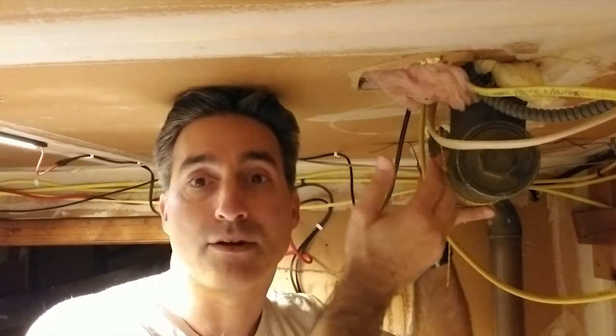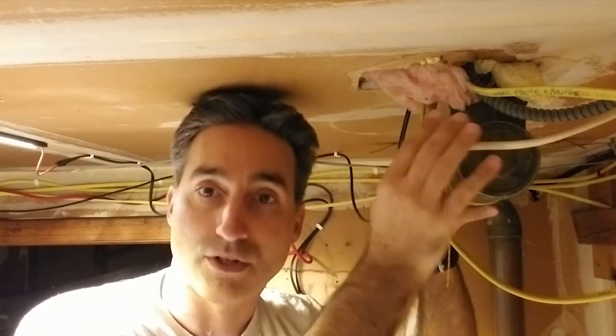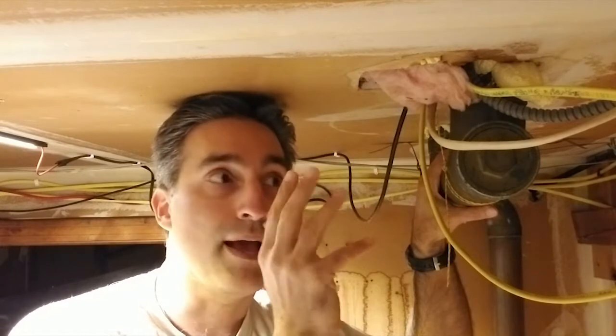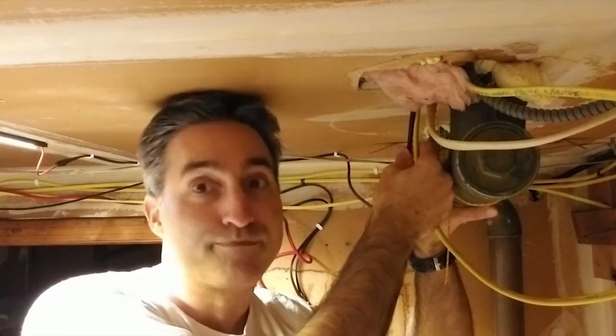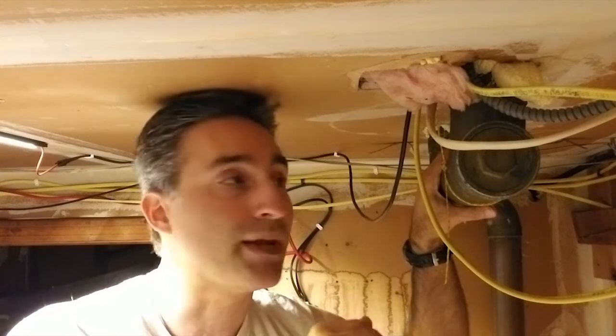What can happen is in the event of, say, an earthquake — the structure shifts, the wire can get pinched between the wood structure and the pipe, and could compromise the installation, cause a short, cause a fire. You also don't want to have low voltage signals sharing a path, even in the same channel between wall studs with high voltage. Same thing could happen: a nail gets driven through, and somehow these two end up pinched together — you now take 120 volts and send it down the low voltage line. Could blow out whatever you have connected, start a fire, damage the equipment — any number of bad things.